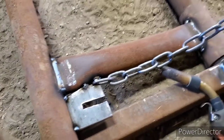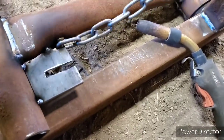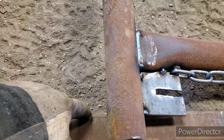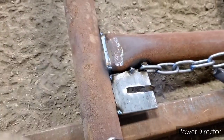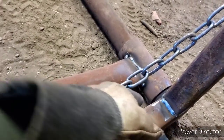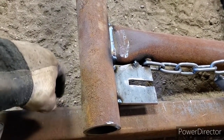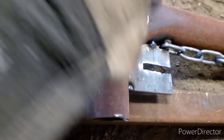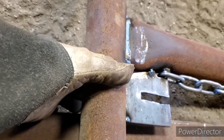When you have that notch cut in there the chain can still move instead of having it solid. It doesn't matter much because it's going to pivot on that link anyway. I'm going to weld all these up solid after, along with all these guys. I measure down from the pipe — I think it's 18 inches — and weld the bottom link right into the plate here, then I can wrap it around.